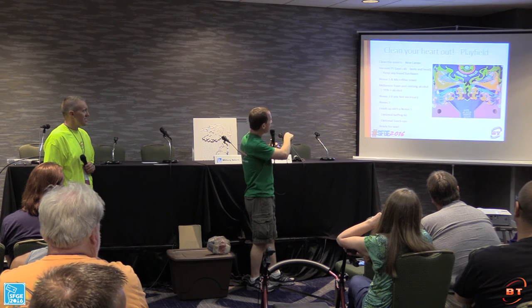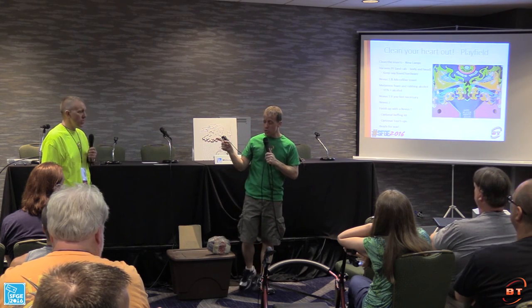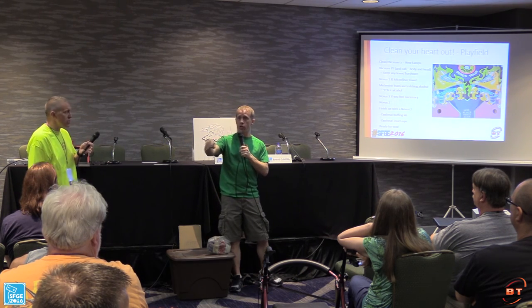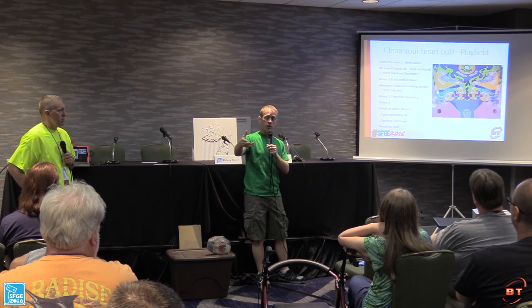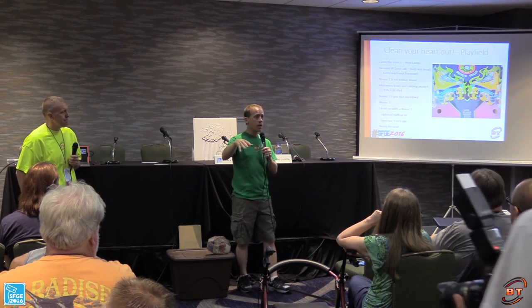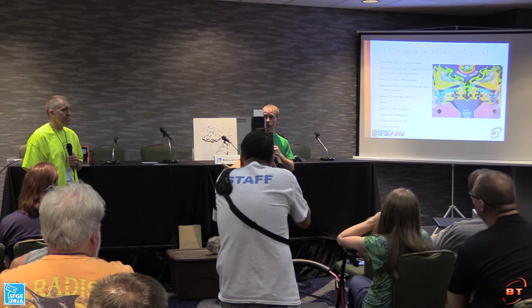If you want, you can get a buffing kit. Is it Treasure Cove? Treasure Cove is one of the companies that offers this buffing kit. It's like if you're going to buff a car, but it's a small buffer, a couple inch diameter, and you put it on a drill, and they have their cleaning solutions and their buffing solutions. You could use that and buff the play field out and get just a mirror finish on it. I've never tried one of those.